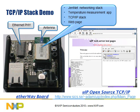It can do a temperature or user application, runs the TCP/IP stack, and it can host web pages with the Perl programming language on them, all in one chip. So it makes a very, very low-cost TCP/IP gateway. You should be able to build this for under $20. All that's required is an Ethernet PHY, which can be capacitively or using transformers coupled into your Ethernet jack.